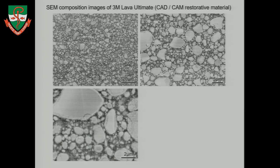These are SEM composition images of the flat surface processed with a cross-section polisher. The acceleration voltage of the SEM was 5 kV. Although the acceleration voltage is high, this is because Okayama University has not installed the latest SEM, which can observe backscattered electron images with an acceleration voltage of 1 kV or less. Structure and composition can be observed even with an acceleration voltage of 5 kV. However, the resolution is low because the accelerating voltage is not low enough. If higher resolution observation is required, TEM or STEM observation is necessary.